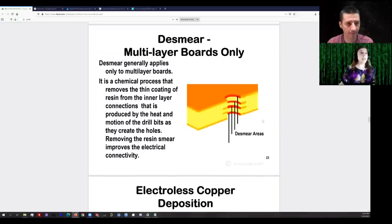In order to electrically connect all of the annular rings within the barrel of a via, you need to make sure you have nice exposed edges of the inner annular ring. So the first thing we have to do before plating on a multi-layer board is remove the drill smear. They do that with a chemical process that generally oxidizes the epoxy — often potassium permanganate in a heated solution.